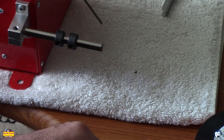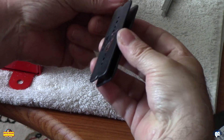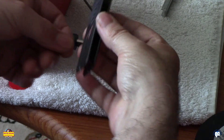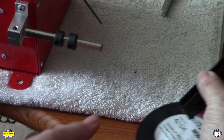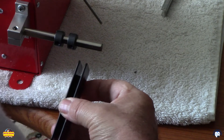What I'm going to do is bunch up a little bit of this wire so I have some to work with at the end. I'll place it on the bottom of the bobbin like that, making sure nothing's sticking out. I've got a couple pieces of pickup tape ready, and I'm going to tape that wire to the bottom of the bobbin. Then I'll pass it up, put it in the center, maybe put a wind or two around it, and hold it with my thumb. I'll set the spool down on the floor so it's out of the way and I won't break it.